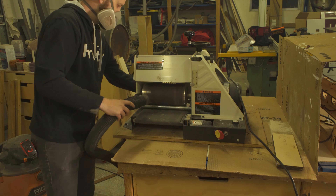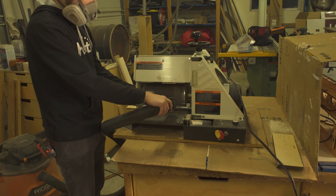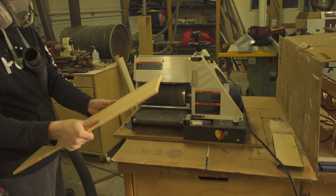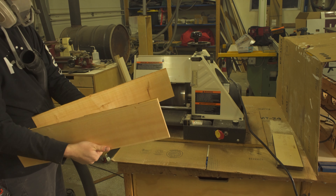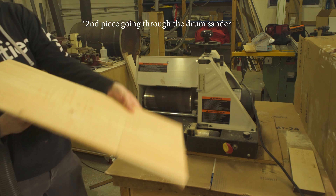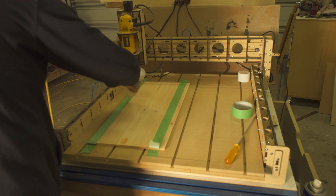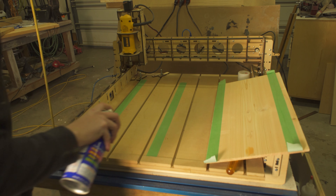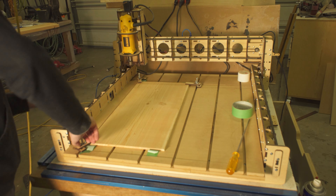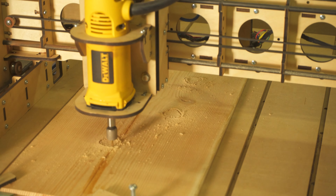For one, it's really large and cumbersome to work with. It's also a lot more fragile than I thought at the thicknesses I needed — case in point coming up right now. And finally, construction lumber like this is not dry all the way through, and warps drastically after milling it down. But here you see me, before I knew all that, optimistically getting my second milled-down piece of 2x12 ready for the CNC. Spoiler alert — it doesn't end up well either.